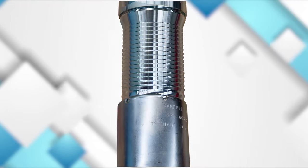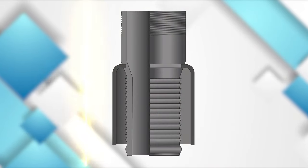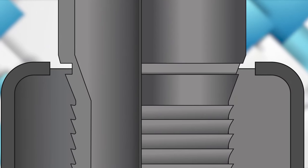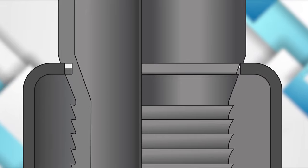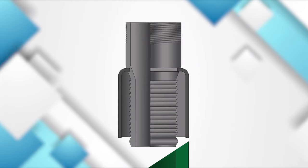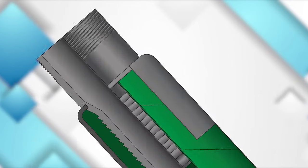This is where the coupling system differs from a traditional crimping sleeve. This interlock provides a point of attachment between the ferrule and the fitting before any crimping is done. After crimping is complete, the system will help promote a long-lasting, secure hose assembly when in use and under pressure. It also promotes an in-line, low-profile look that has no sharp edges.